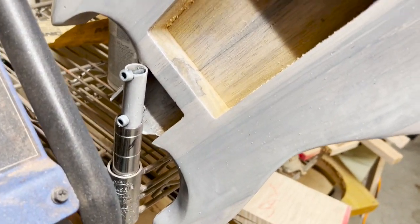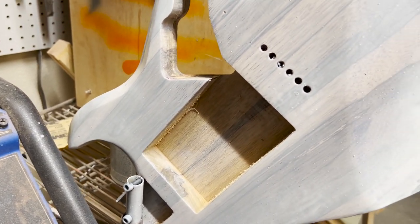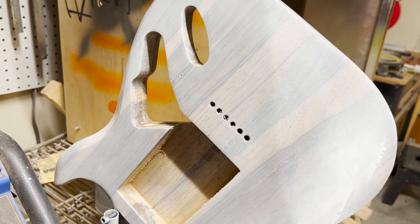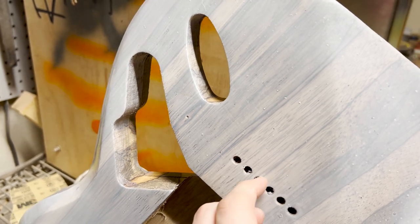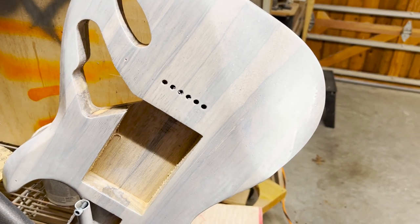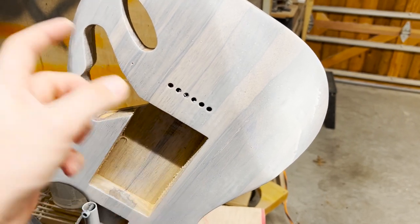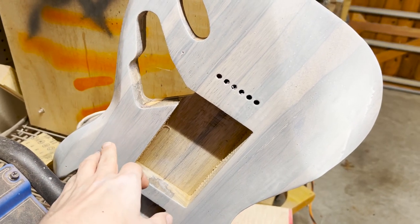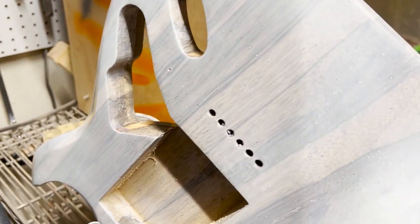And I'm still warming up on the white. It kind of came out as like a cool snowy gray, which I'll have to see how the gradient looks, but it might just work. I'm interested. I do want to keep the wood grain pretty exposed, and the way that you do that is, the more coats that you put on, the more opaque, because you're putting on more coats and thusly more pigment, because the pigment is blended into the top coat. So the more that you put on, the more opaque it is. But if you only go at it with like one or two passes of each color, you still get this beautiful effect. Again, all part of the process is coming together, and it looks really, really nice, at least at the first coat.